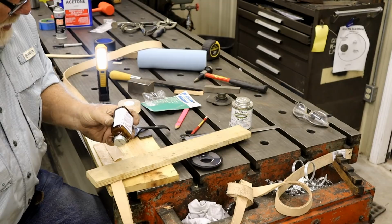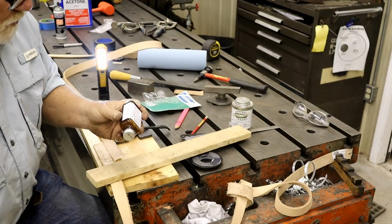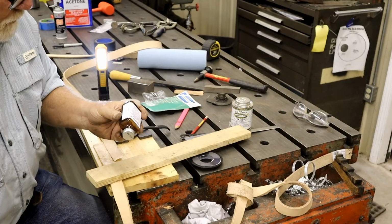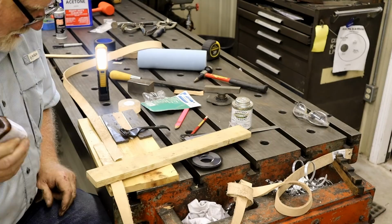Add a thin uniform coat to each surface. Permit both to dry completely. If one surface is extremely porous, which both of these are, apply a second coat and permit to dry. When ready to assemble, apply an additional coat to one surface. When tacky, push firmly together. Use pressure if possible during final bonding. Total cure strength develops in 7 days, but it can be handled immediately.